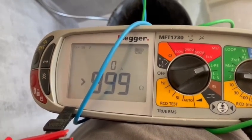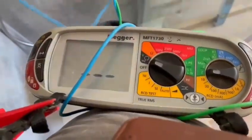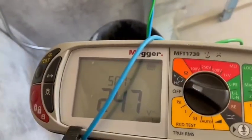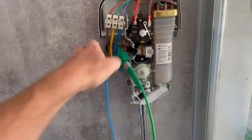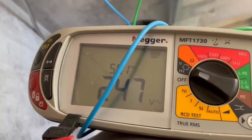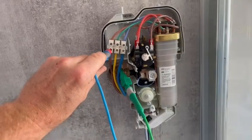...but it's just not able to get good enough continuity to get a reading. If we switch to voltage and go on to where we've got a good earth, we get 247 volts. Now going on to the brass compression fitting and the line, it will actually pick up 247 volts there, but it's not picking up when we do the earth fault loop impedance test. So I just thought that was an interesting demonstration to show some of you guys.